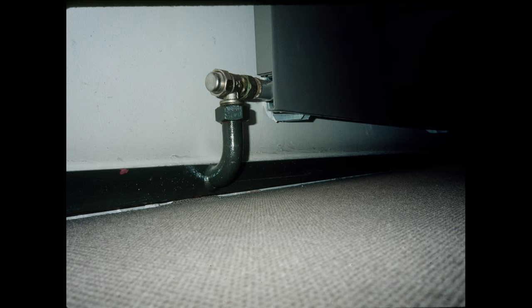This guy had a circulator, and then he had a four-way valve, which can make the water go in different directions. And then he had a timer. So for every half an hour, he's got the water going clockwise around this big loop. And then the circulator shuts off, it switches the four-way valve, and the water now goes the opposite direction for half an hour. So every half hour, he's reversing the flow through the entire system. This guy gets the hot water first. Half an hour later, the other guy gets the hot water first. And that works. So it's very hard to argue with success, and that's what they were doing in this building.